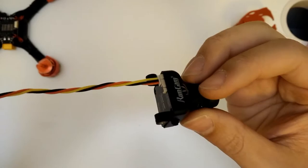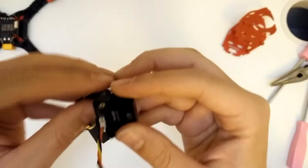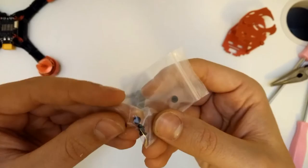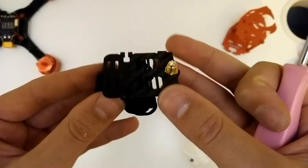Now we can add the camera. Go ahead and attach this black, yellow, and red wire — that's going to go into the top left port here; we're not going to use the other port for the time being — then pop that camera into the holder. It's clicked in and free to move. We can now put some screws in here to fix the angle. Use two more screws from the bag to attach the camera angle — no need to over-tighten those because you'll probably want to change the camera angle at some point. The camera plate is now done.